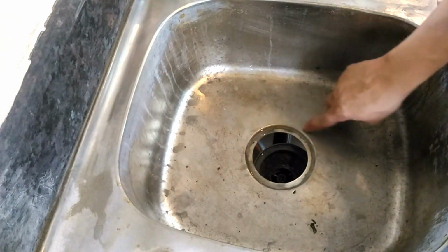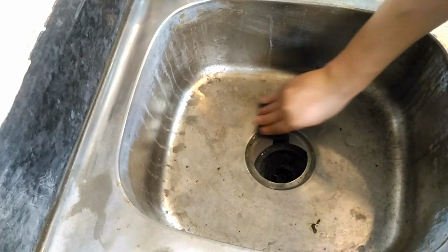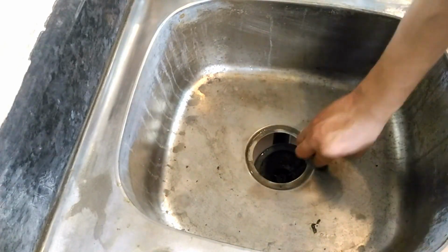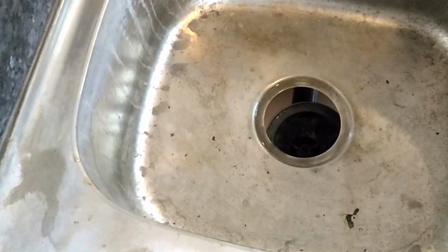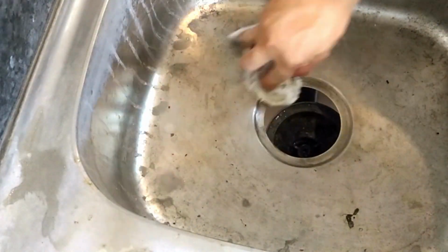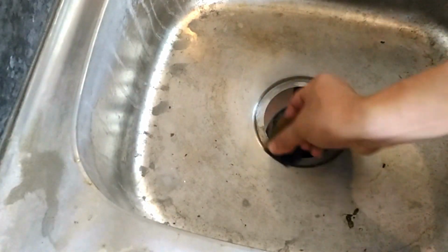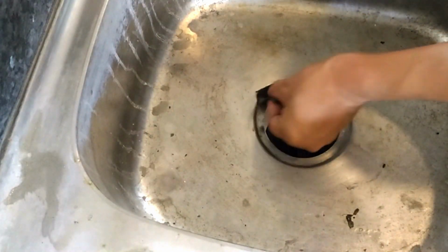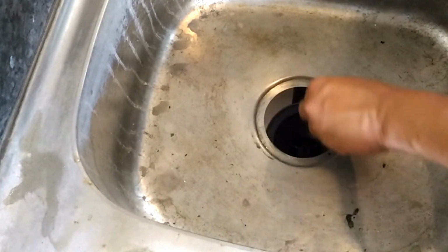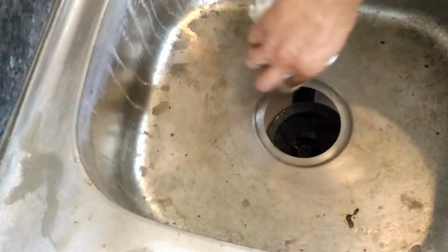The second part we're gonna fix is the left water drain of our dual sink, and we need to wet sand the area around the hole. Pay particular attention to the indentation or recess around the hole. This needs to be ultra smooth because it is where the rubber gasket of our new drain will go. Any rust or grain or any uneven surface should be removed in order to create a flat, watertight seal later.